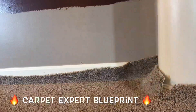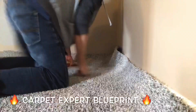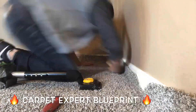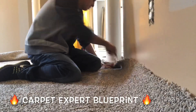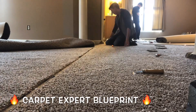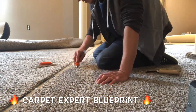Slowly work your way around all those angles there, putting mad pressure on that kicker when you kick it because it's a lot of open room — you want to make sure you're getting it stretched tight. Really we should have used a power stretcher on this one, but I got mad kicking skills so I was just able to kick everything, no big deal. I know the comments will be flooded saying it's going to ripple right away, and it might — we'll take care of that, don't worry.